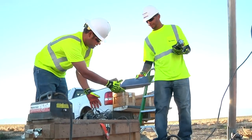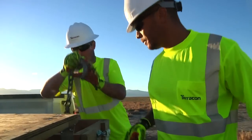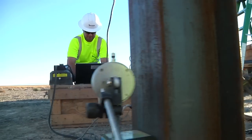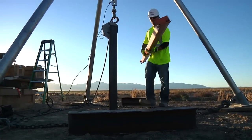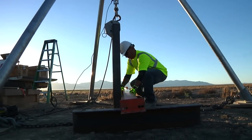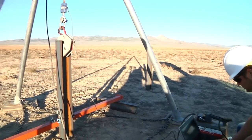There are two engineers operating the test for safety reasons, but actually nobody's taking notes. With this system, no one has to get in possible harm's way by getting close to a loaded pile in order to take a reading from a dial gauge. We're getting real-time automated data collection.